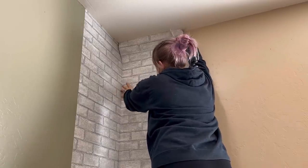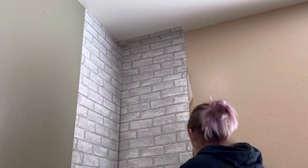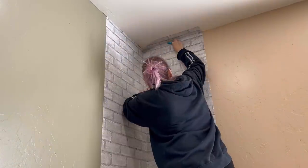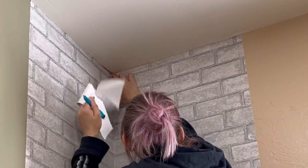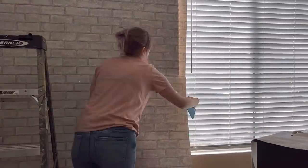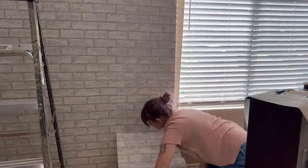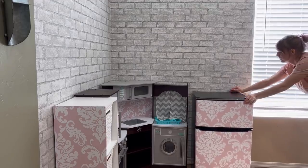Because I'm not doing too much space, I went ahead and just lined it up with the edge of the wall — which is never perfectly straight, but it's pretty forgiving since I'm only doing about three panels on each side. With a pattern like this you have to line it up perfectly or it just won't look right, so if you want something really easy you can find a solid color or a really busy pattern where you don't have to worry about it. I worked my way down from the top, slowly removing the backing as I went so that I had more control. Wallpaper can slightly shrink when it's on the wall, so just barely overlap it — just the tiniest little bit.